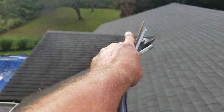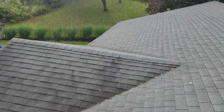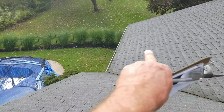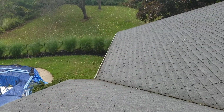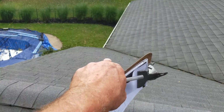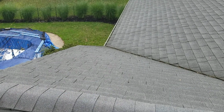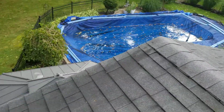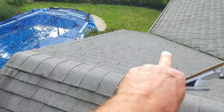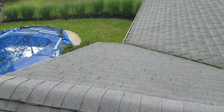This gutter over here and this gutter here has been giving them problems. This gutter I know is over pitched, because I can see that gutter's really low over there for some reason. Probably because now I'm looking at this little 3-foot jet out here of this gable that dips down almost 2 to 3 inches. This one looks pretty level, but this one definitely has a pitch down that way, so they had to pitch that a long ways, or real steep, to get that back to the valley.